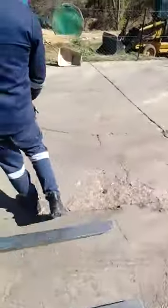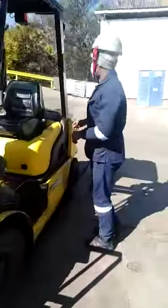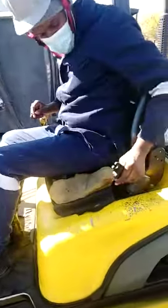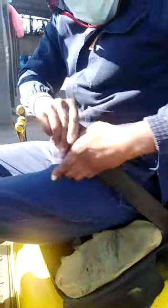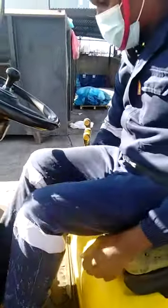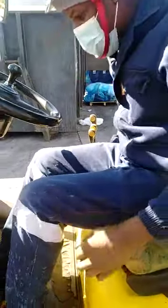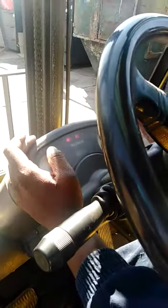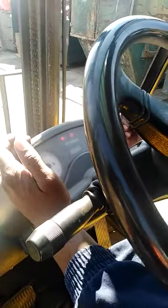Then we get on top of the truck. Every time we mount a truck we follow a set of steps. Point of contact. Then we put on the seat belt. Adjust the seat so your legs are in good contact with the pedals. Then adjust the steering as well. We switch on the display and check the gauge if it is all working, to get a good idea of what is going on with the machine. Then we check the hours of the machine before working, or before the start of shift.